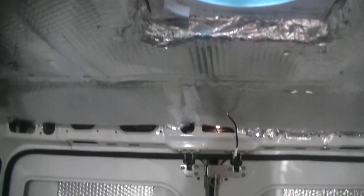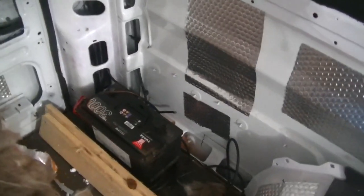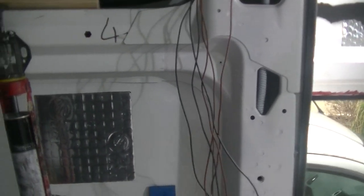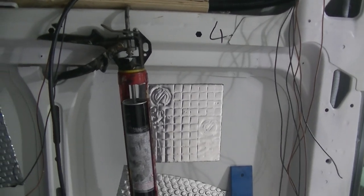So what I'm going to do now guys is, before we put the ceiling up, I want to go ahead and jerry rig up all this lighting just to make sure it's all working, because the last thing I want to do is put the ceiling up and the lighting's not working. So I'm just going to rig the lighting up to a battery that I've got down here in the corner. I will put it all on a fuse. I'm going to have my switches over this side just as you're coming through the door. So I'm just going to put a temporary switch in, and then hopefully it gives us a bit more lighting in here for when we're doing our recording. So I'm just going to go ahead now and sort that out.